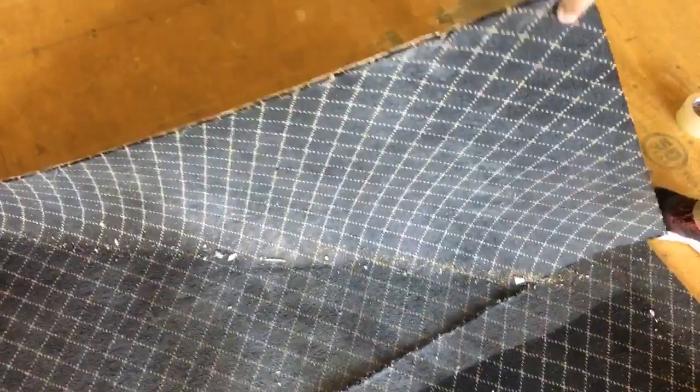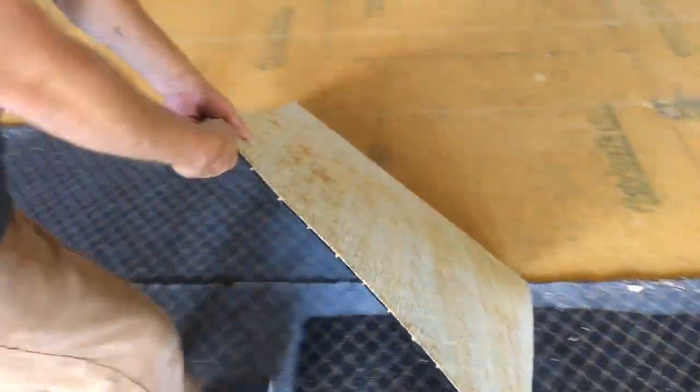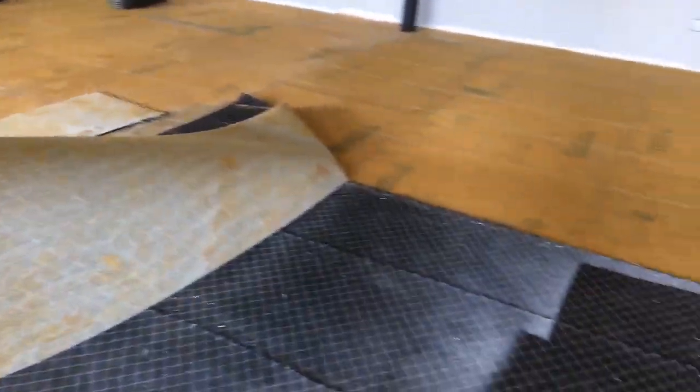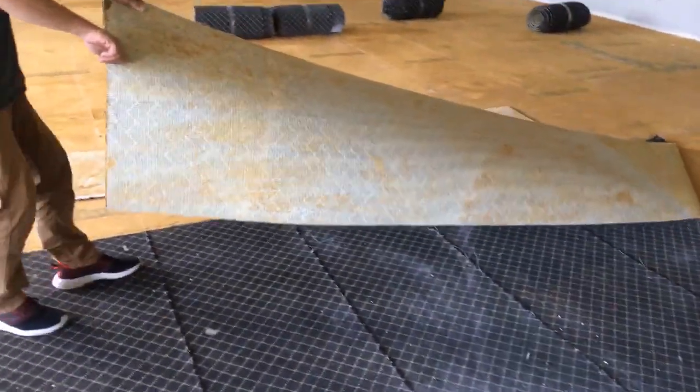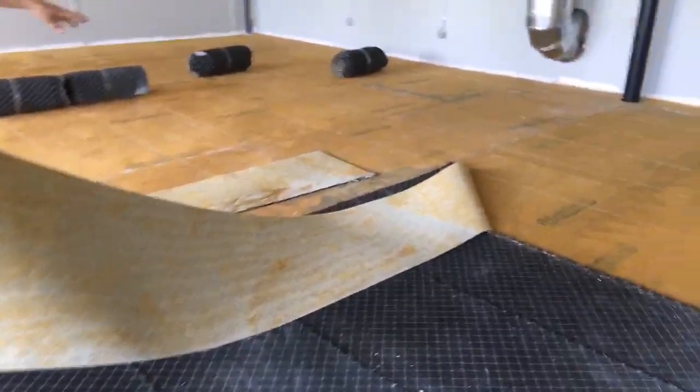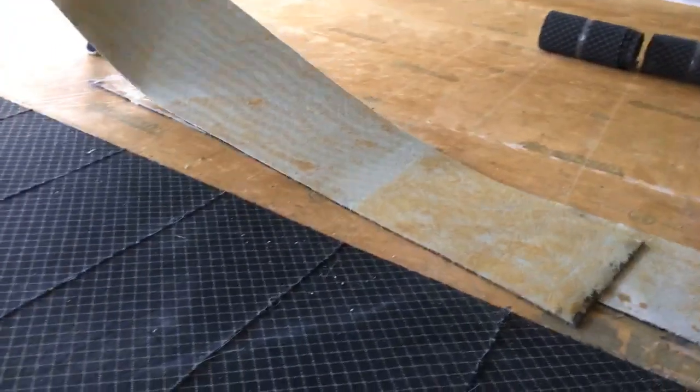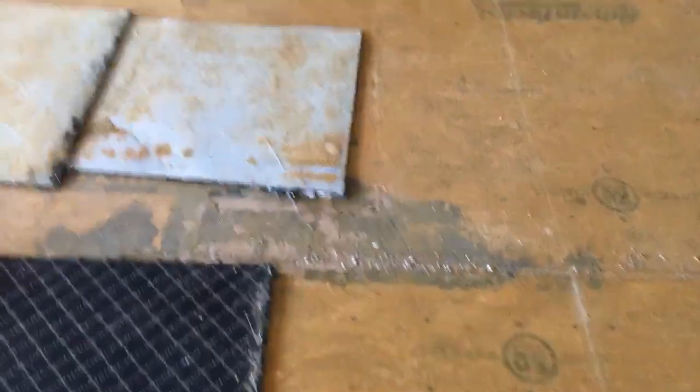See how it kind of runs to the edge — I'm pulling it back and it's dumping all the garbage that was on this piece onto my very next piece of carpet that's still down. On the end where it hits the bare subfloor there will be a little bit of garbage, but for the most part all my debris is staying right on my carpet and I'm keeping the floor pretty clean.